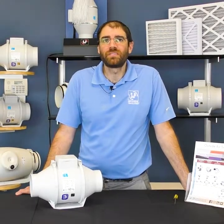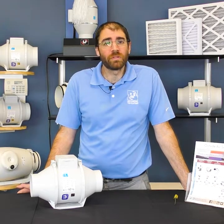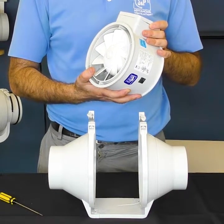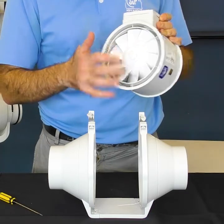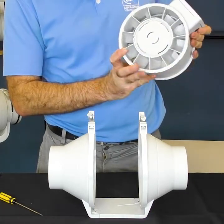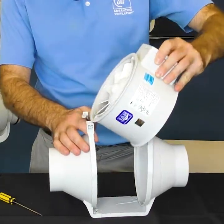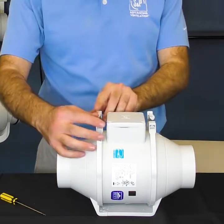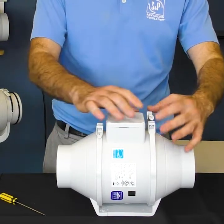To replace the motor, place the motor section back into the mounting bracket. When performing this step, it is important to ensure the motor section is oriented in the proper direction. The exposed wheel is the inlet side and the side with the fixed airflow vanes is the outlet. Then tighten the straps by simply pinching the protruding tabs along the strap together to secure the motor section in place.